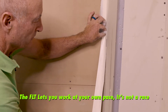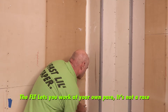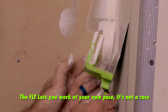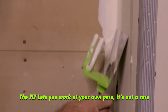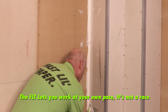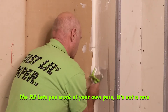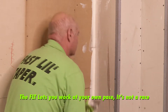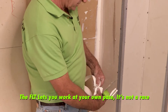Wipe the knife off, then turn the tape upside down so the compound-coated end leads. Butt it right up next to the other tape, walk it down with your fingers, center it right in the joint, then come back and smooth it out about a foot at a time. If you see any wrinkles or bubbles, stop and smooth them out right now — this saves you so much time over pre-mudding the joint by hand and then trying to embed the tape.